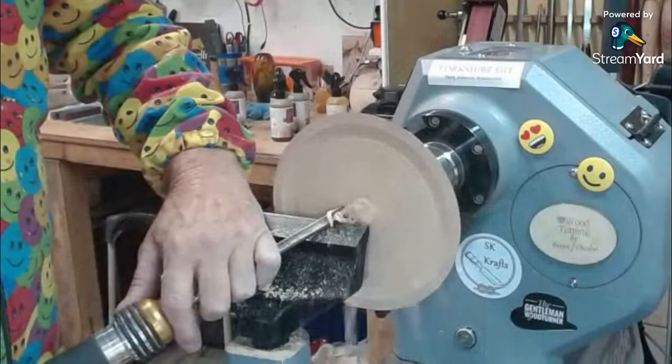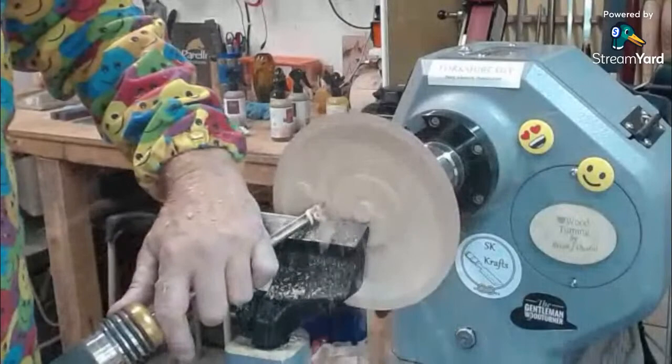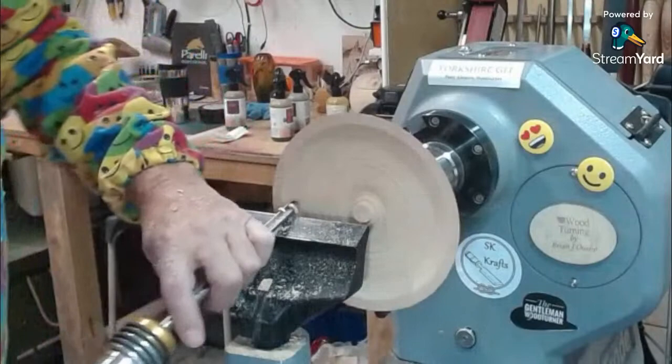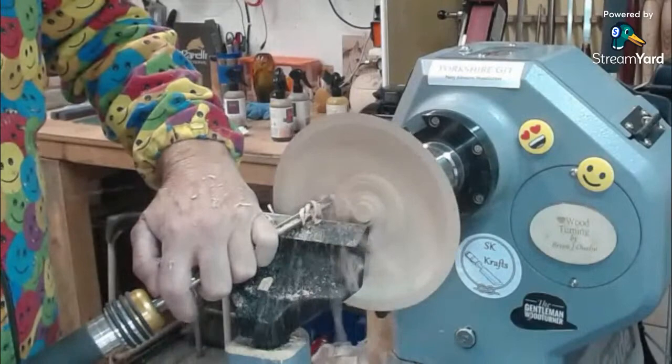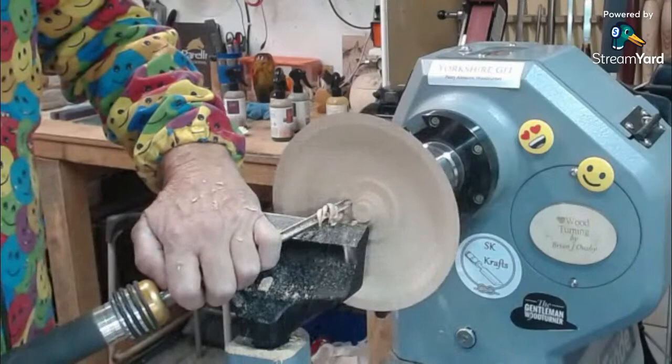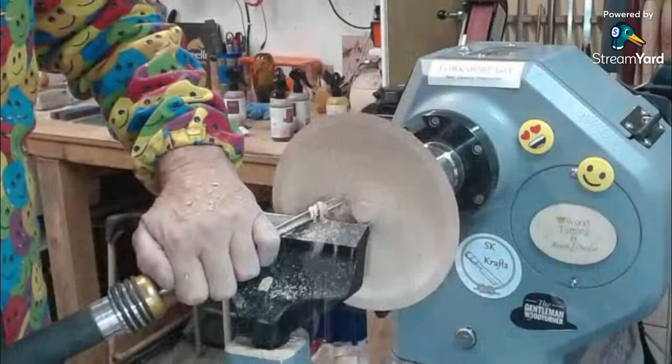Right, Steve Ash is asking a question. He's saying, does the SK100 have a locking screw on it? I bought an oldie special lathe for 80 quid with an SK100 on it. He can't get the chuck off. Right, if it's got a locking screw, it will be visible in a collar at the back of the chuck. Is it two or three grub screws in that one? I think it's two. And they'll be just little hex-headed grub screws, and they'll be quite visible. More likely, it's just been left on there a long time and it's seized on.